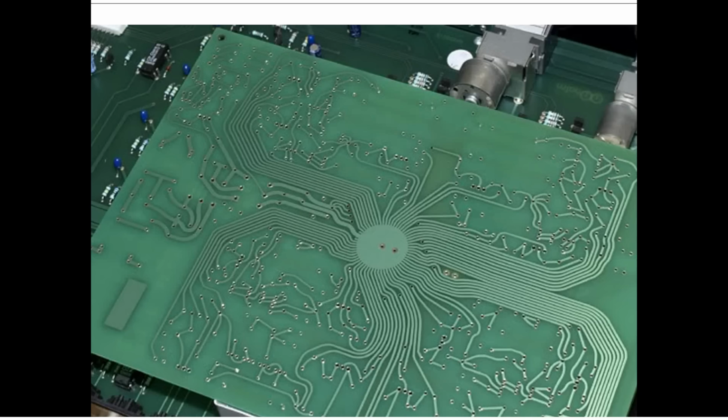It's not a fix-all because obviously now these traces have a lot more inductance, and if they were passing a large current, they have reduced current handling capability because you have a smaller trace running a greater distance. So it depends a lot on the specific design. This is lower frequency, so this is all audio frequency stuff, that shouldn't be nearly as big an issue. If you were looking at higher frequency or digital circuit boards, you couldn't do this.